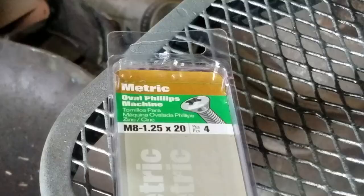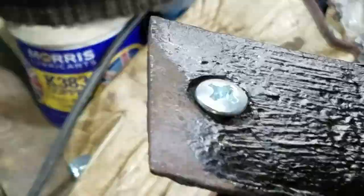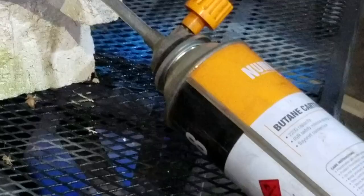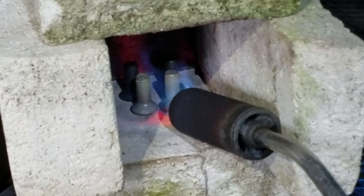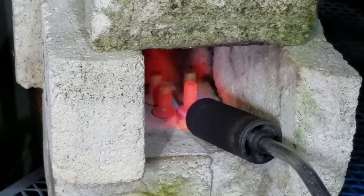I've got a selection of bolts from various hardware stores. I knew that the allen-headed cap screws were going to be quite hard, but I needed something with a tapered seat. I settled on these ones and made myself a little kiln out of refractory bricks. I've set the screws up inside the kiln because I only have this chef's torch — designed for flambéing the tops of pies — which doesn't have much power, but by holding the heat in I was able to get the four rivets as hot as they needed to be.